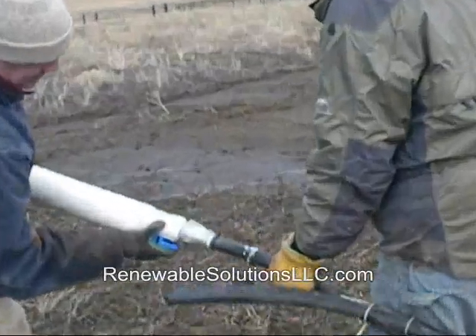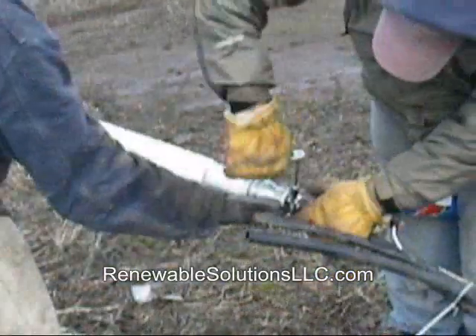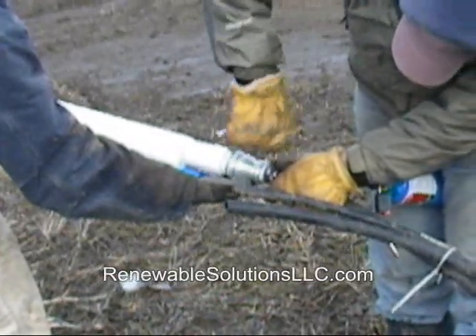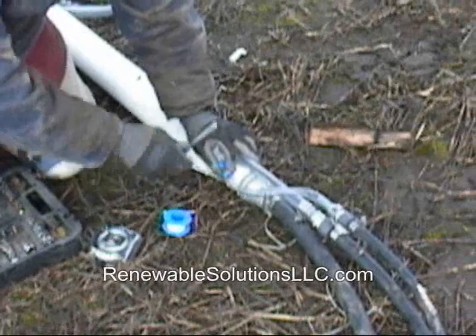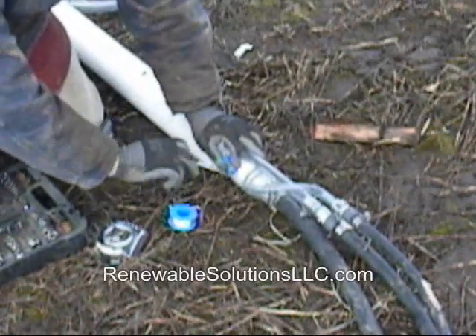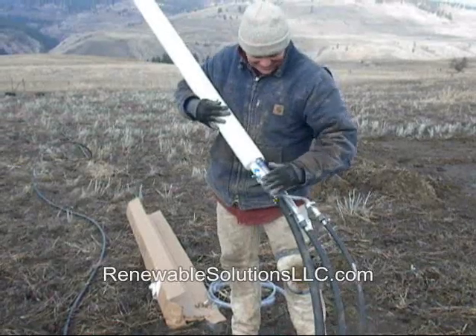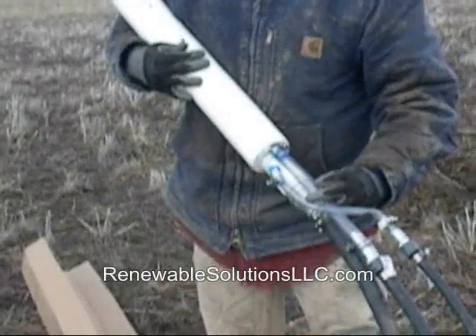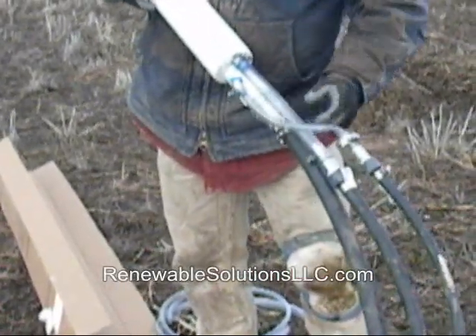Let's get started. The pump has three nozzles: one intake for compressed air, one exhaust for released air, and one water hose. Water intakes through the plastic grate on the bottom of the pump and exits through the top. First, we hook up polyethylene tubing to the pump using standard fittings and hose clamps. Remember, the two small nozzles are for air and the large nozzle is for water.